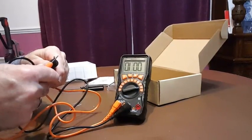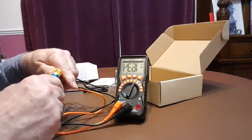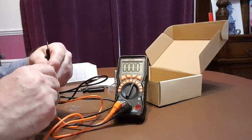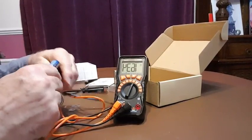So there's the resistance range on 0. And now I'm measuring a one and a half volt battery. First of all I put the leads on deliberately the wrong way around and it measures minus 1.6, and then I'll put them on the right way around and it measures plus 1.6. I'm sorry that the video is a mirror image — I'm not quite sure why that is. I might see if I can rotate it in a minute.